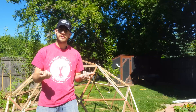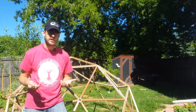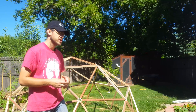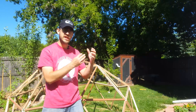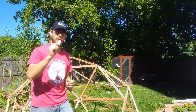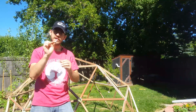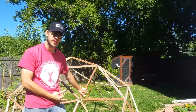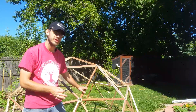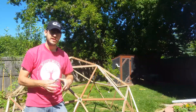If you're familiar with geodesic domes or looking into them, one of the biggest reasons people don't build them is because they can get complicated. You've got all these different lengths of struts and all these different angles that you need to cut, and everything needs to fit together at each node just right. It can be very overwhelming. But with these simple connectors — and it's always the simple ideas that are the best — I built this in about two hours total, including cutting around 125-130 struts, connecting everything, and putting it all together. It's extremely simple.